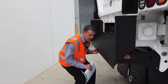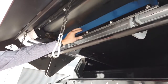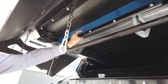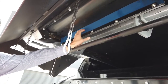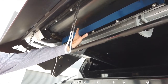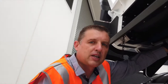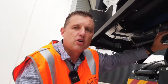You need to get under the back of the asphalt tongue, where there's a plastic scraper designed to scrape any product buildup on the belt as it runs around. This plastic scraper is a hard engineering plastic and it doesn't bounce back if it bends. If you leave asphalt to go hard on the belt, the asphalt will hit the plastic and bend it backwards, and the symptom will be asphalt all over your chassis on future loads.